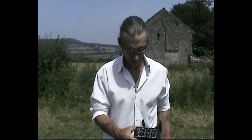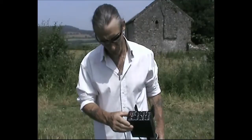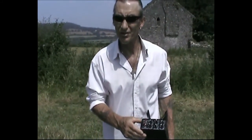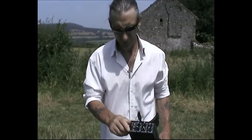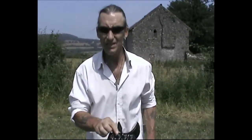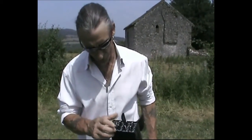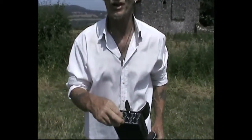I'd like to show you how to start off with these great machines. Basically what we have here, we have two ground modes, manual and auto. We have auto zones that correlate with the auto ground balance. We have a discrimination toggle that deals with surface discrimination. We have the gain, which is the amplification of your target, as you know. And that ranges from 1 to 10. We have a tone. Our tone ranges from 1 to 10. I like mine on 8.